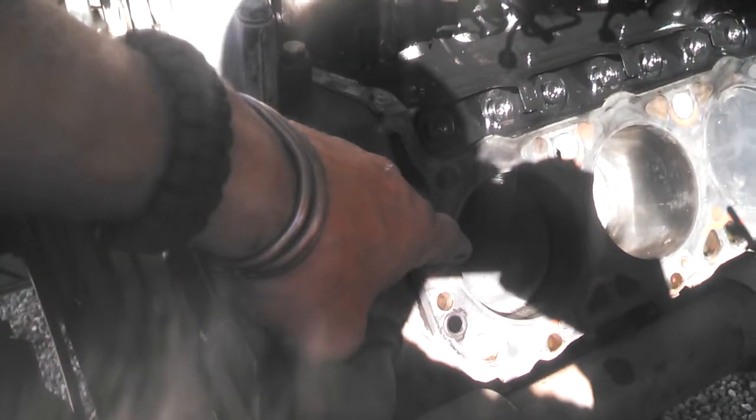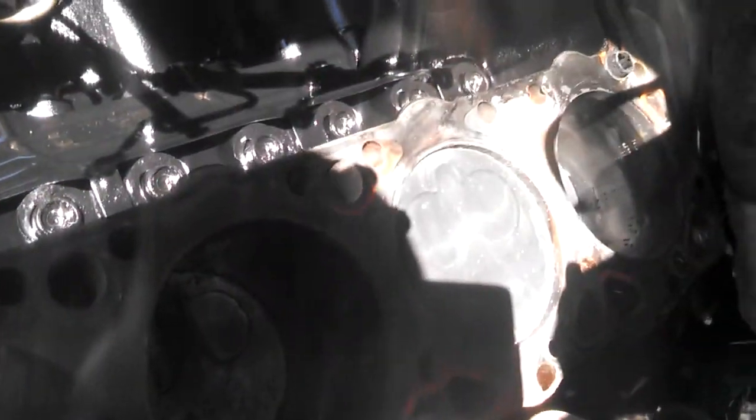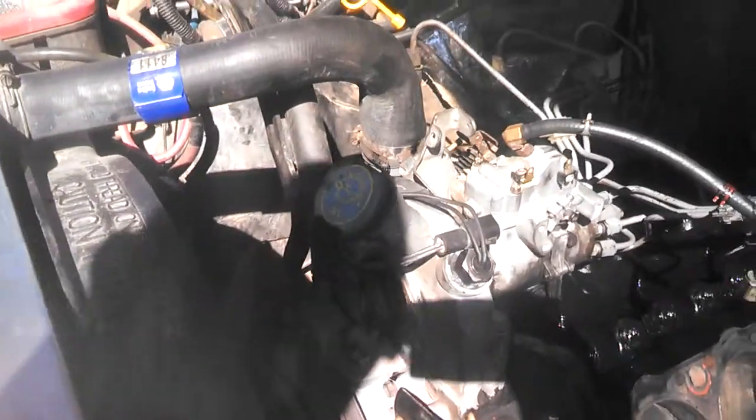Notice that this is just changing the position to which the distribution of the fuel occurs in relation to where the pistons are at top dead center. Now theoretically with those lines lined up, this truck would fire and run — except there's a pretty substantial crack in there, it's nasty. All the other pistons look okay, so hopefully that helps. There we go — that right there lines up with that dowel right there.